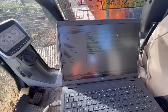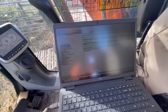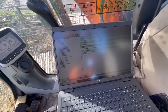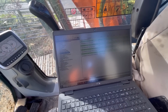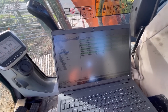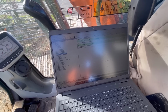So if I open this page, it's slow today, and go to the after treatment system stuff, and we can just sort of keep an eye on various bits and pieces. SCR, yeah, so I'll keep an eye on the AdBlue pressure and everything. Once it's warmed up, it's just priming itself at the minute, but yeah, we'll just let it do its thing.